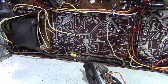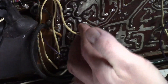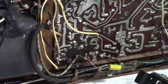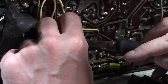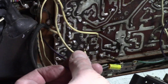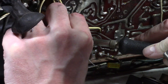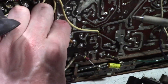To get the wires off, at first I heated up the lug and tried to unloop the wire a bit and pull it off. But then I realized, accidentally, that it's actually easier to heat up the whole thing and pull the pin out. These wires are wrapped around pins that are almost like stakes stuck into the board and soldered in. I tried it and on the shielded cable one, the wire just pulled off rather than the stake coming out.